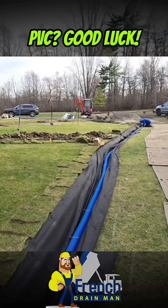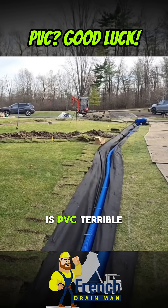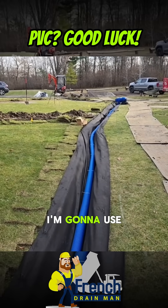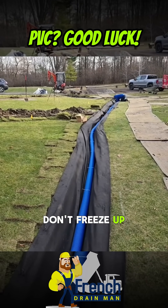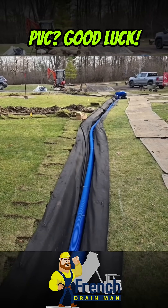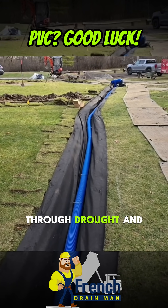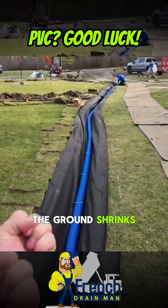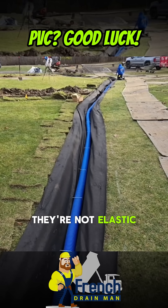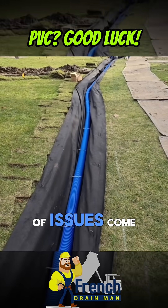There's no glue joints, there's no fittings holding it together. When you do PVC, not only is PVC terrible because the ground always kind of moves and shifts — if you're in the south and you're saying I'm going to use PVC because my system doesn't freeze up like the north, so I don't have to worry about it cracking — I want to educate you on this. When the ground swells up with water, it moves. When you go through drought and the ground shrinks, it moves. And the PVC joints aren't rubber, they're not elastic. They weld solid, so they crack and tree roots get in them and all kinds of issues come with that.